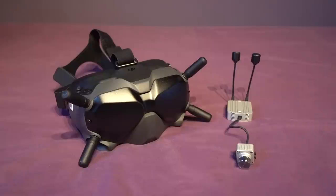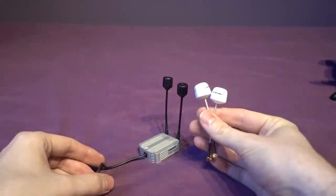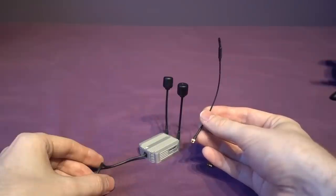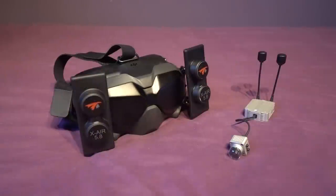I'm going to start off with the air unit antennas because it's an easy one. I haven't found any significant difference swapping them out at all, and that's because the difference in gain from an omni antenna is never going to be that significant. Interestingly, linear antennas seem to produce good results, which could be down to all of the transmit and receive methods that they are using. If you are using the full power output — whether that's 700mW or the 1200mW mod — and are flying within line of sight, perhaps around a couple of trees or around the exterior of a couple of buildings, then you aren't going to notice a significant difference switching from the stock antennas, because trees aren't that dense and flying around buildings doesn't cause too many issues until you start flying inside them.